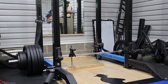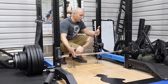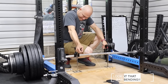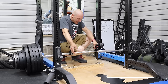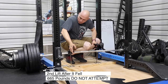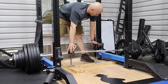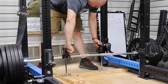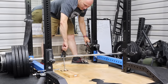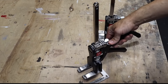Next is 595, then 665 pounds — give or take a pound or two. I'm having to squeeze it pretty good, but it's off the ground about an inch and a half. Letting down 665 pounds — the left button handles that. 665 pounds — like a boss, no problem. Right after the 665-pound load, everything still works like it's supposed to. Don't try that at home. I just wanted to see how they'd operate under a very heavy load.